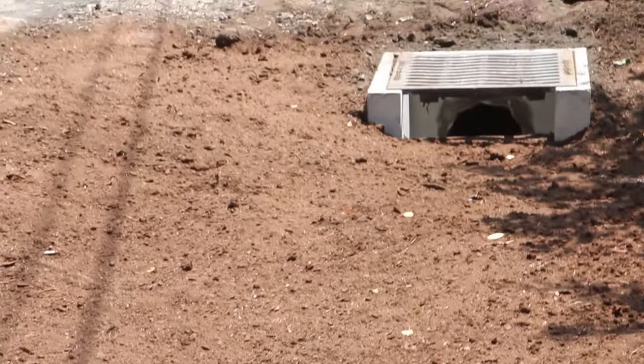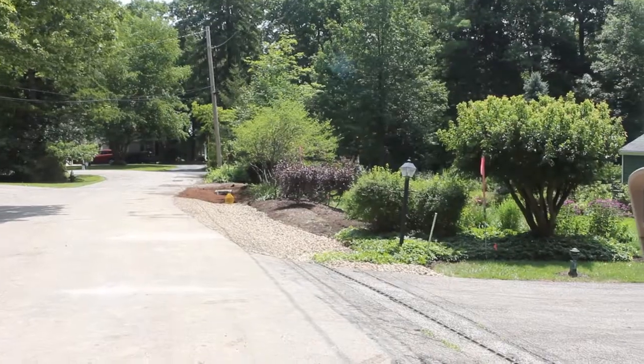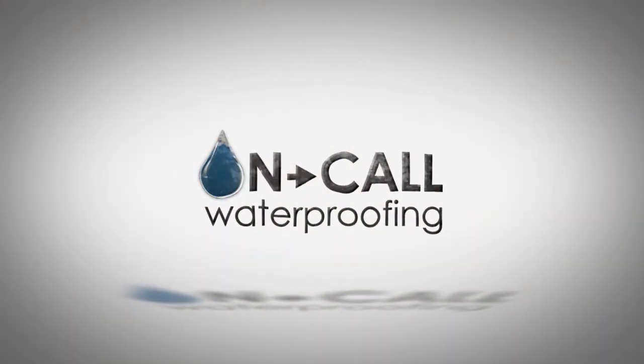And then there's usually an outlet side to it, so once it retains a certain amount of water, it can purge itself back into the storm sewer system. So now that water runs down the street, falls off the edge of the curbing and into the bioretention pond, gets captured and then channeled away from the house.